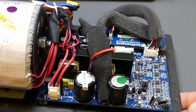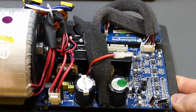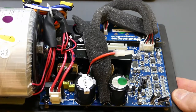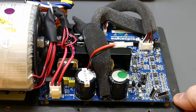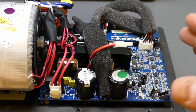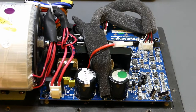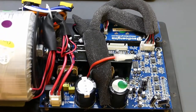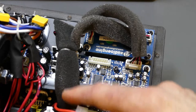I took a look at the amplifier ICs — these are off-the-shelf integrated circuits. They are TDA7294s, if you're interested — look that up. I've used that in another project and it was a very good-sounding unit. This one is an ST part — the ST TDA7294. There are two of them, so both channels of the amplifier are in this speaker side, and they use a simple passive crossover in each speaker to handle frequency response.